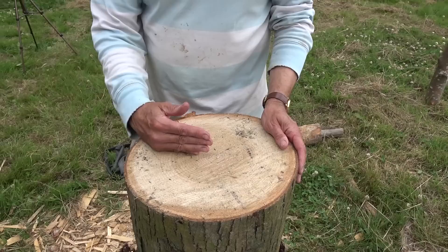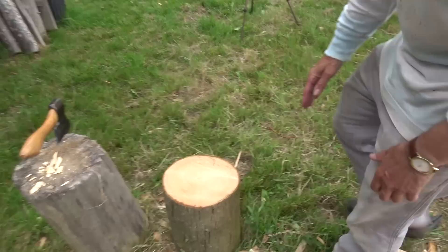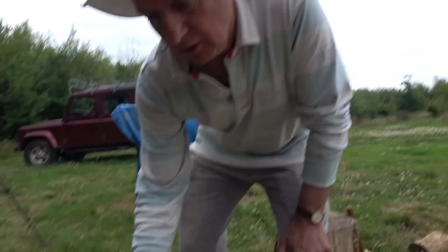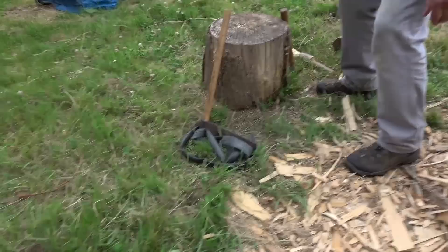The two logs we're going to work on today — this one is a little bit smaller than I would like. We will cut this one radially in wedges, like cutting a cheese. And this smaller one over here we'll cut laterally across. There are two different methods. With the lateral method you can use smaller logs, but the shingle itself is less stable.